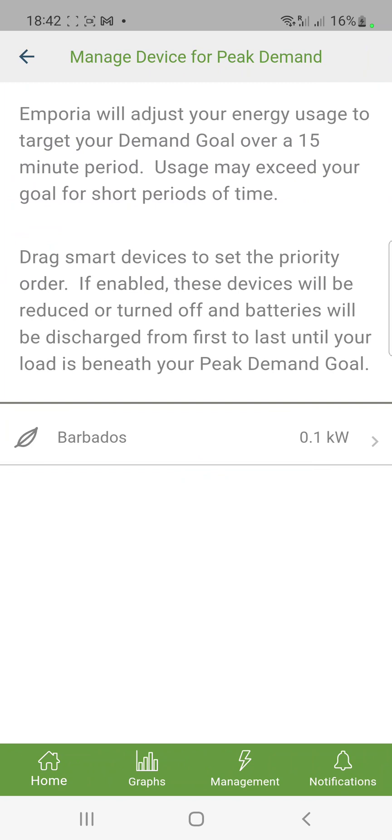The peak demand function is for people who don't have large circuits in their house and are afraid that if they charge the car the circuit might be overloaded and trip a breaker. What this does is you can set how much power you want to pull from the grid at any point in time when the car is being charged. If you turn on a dryer or something large and you begin to exceed that power rating, the charge controller will ramp down to free up the extra capacity so that power can be used by the dryer or some large load.